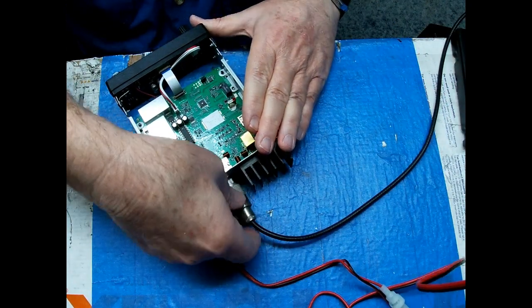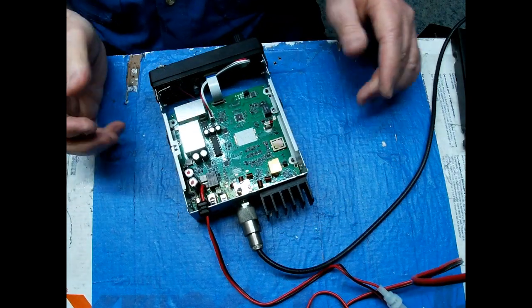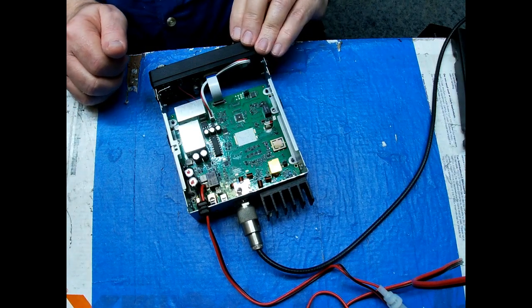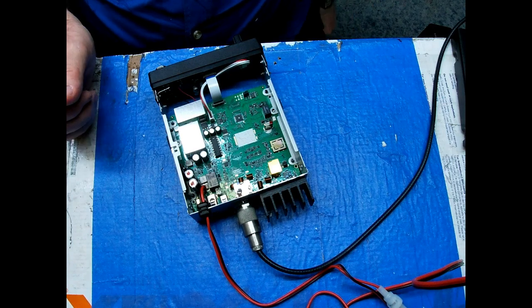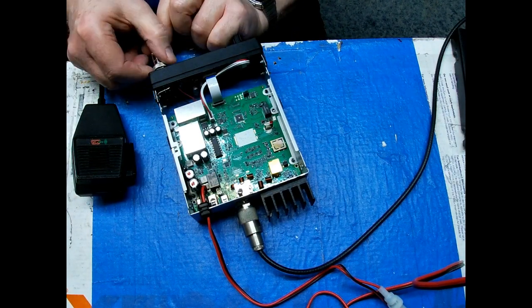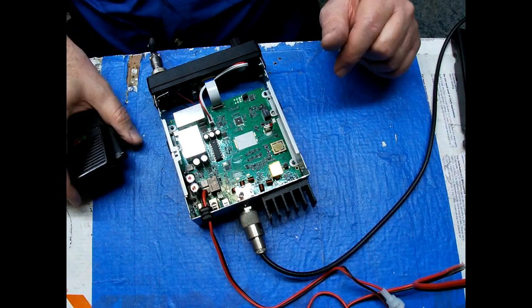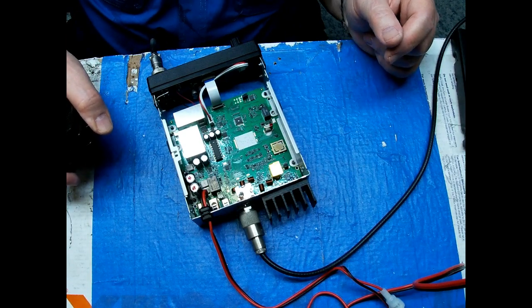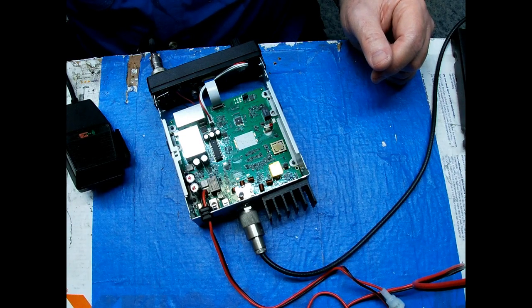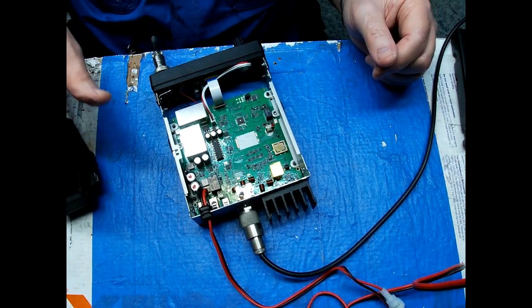The biggest benefit for these little President radios is a receiver. You'll see what I'm talking about. Super sensitive, very quiet. Hello, audio, hello. Hello, audio. It's got pretty good forward swing. We're dead keying. I'd say that's 5 watts, not 6. Hello, audio. It goes up, it forward swings to about 18 watts. PEP, that is. Now, RMS, audio. Goes up about a half a watt.